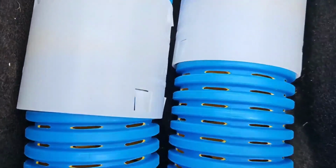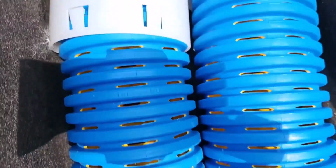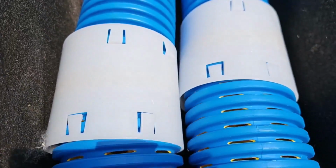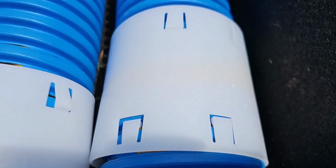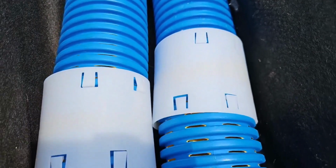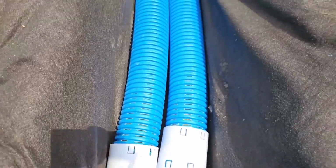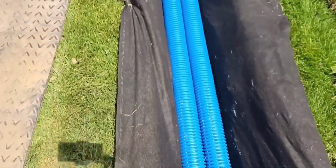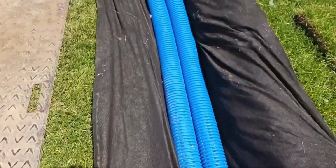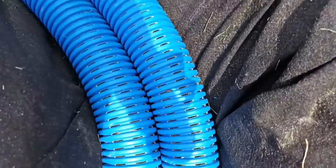And because it's 240 feet, our 100-foot rolls of pipe ran out right here, and we're using external couplers versus internal couplers. The only reason why internal couplers exist for corrugated pipe is because when they're putting in agricultural drainage, they come off spools and they go through a tile plow. And if you put an external coupler on, it'll get caught. So they had to come up with these internal couplers. But now they've been just misused.